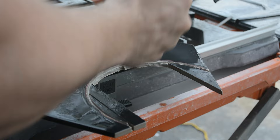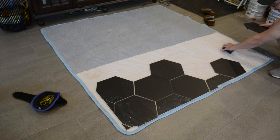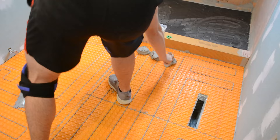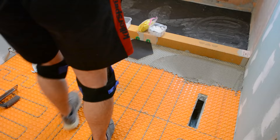After knocking those off by hand, I came back with the angle grinder to clean up the edge, though the toilet ended up covering most of that cut anyway. Then I went ahead and pre-cut all my tiles — I dry fit them in the room, and I find this is the best workflow so everything's ready to go when you mix up your mortar and you're not waiting on cutting tiles while the mortar starts to dry. Once all the tiles were cut, I mixed up the mortar and started laying tile, burning that Schluter Allset into the Ditra Heat, filling in all the gaps to get a flat surface, then adding mortar on top to create a grooved surface to lay the tile on.